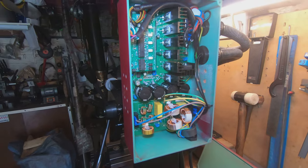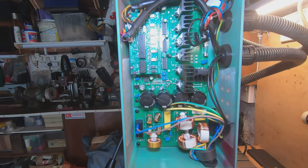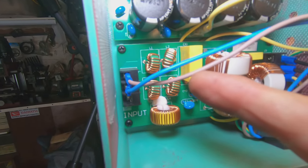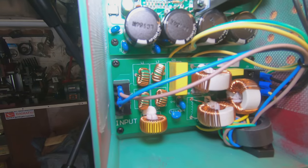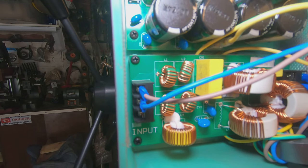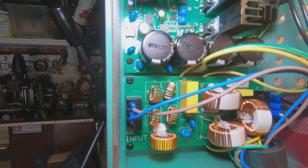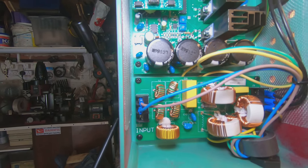I've just taken off the back of the control box on the SX2P mill, looking for any 12V by happy chance. There isn't any, however this is where the mains power comes in — blue is neutral, brown is live — and it looks relatively simple to tap a little pigtail off there. I should point out at this stage: electricity is extremely dangerous. 240V can kill you, and probably 110V can too if you're in America.